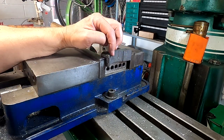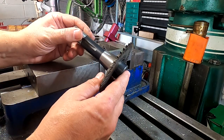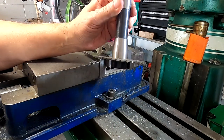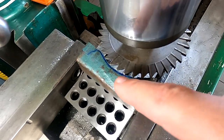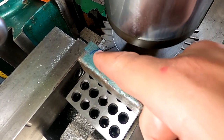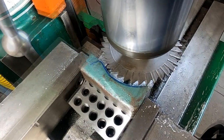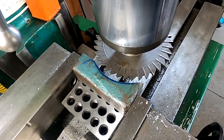I realize that this is a 4-inch radius, so why don't we just take a saw like this and trim our 4-inch radius into this and see if that works, okay? Okay, so we can line up the blade with that original line that I drew, and that'll put us on our true radius. And I've locked the y-axis, and I'll back the x-axis out here.